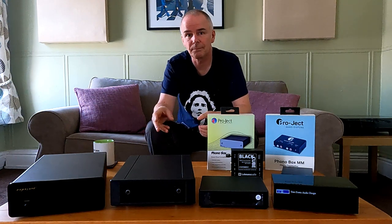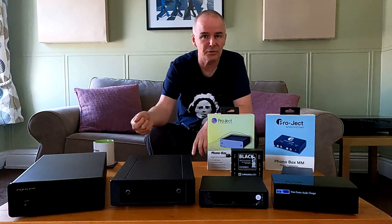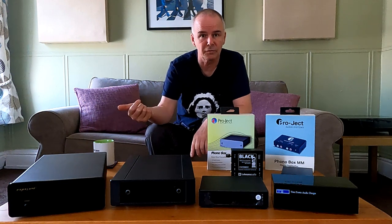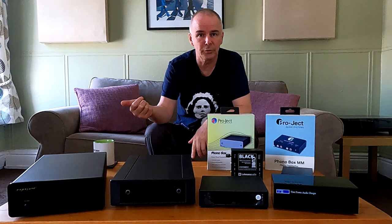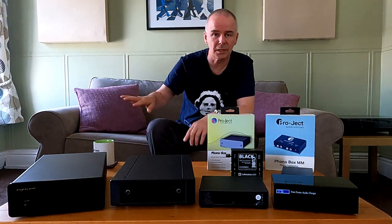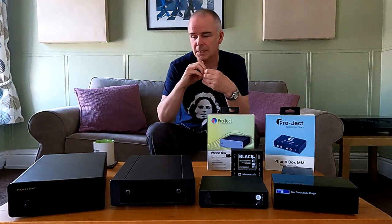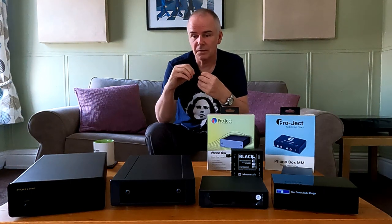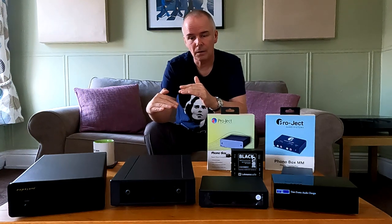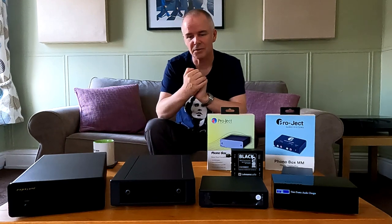The record player needs another circuit because it's very, very low output. If you plug a record player straight into a line input on an amplifier and turn the volume to full, you can barely hear it — it's multiple times quieter. It's also not a flat response; it's got a big lump in it and it's all over the place, so it needs equalising. It's quite a complex and difficult circuit to get right, very susceptible to picking up and amplifying noise.